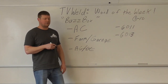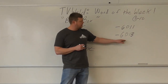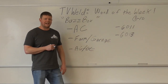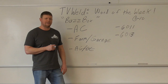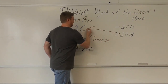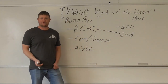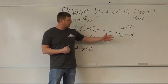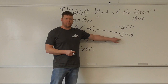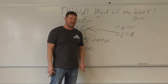I found a bunch of 6013 rods the other day in an old box and got all excited. I started running it and it didn't run like I remembered. I looked it up and realized 6013 is an AC-only rod, and I had been welding it in high school on direct current electrode positive. So I started welding it on AC and it came out a lot better — that's why it ran a little off when I was running it in the lab.